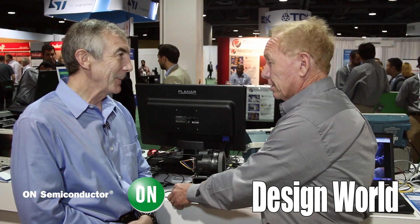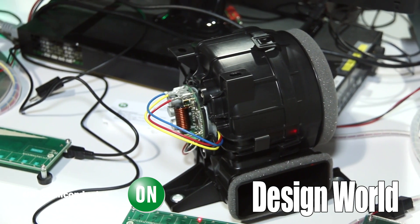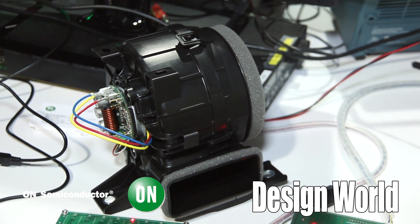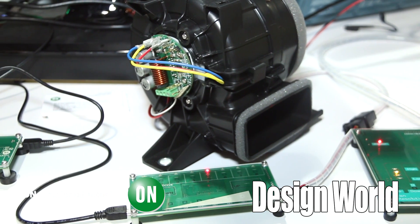The chip is basically a velocity controller — correct? That is correct, yes. And does it do any position controlling? It is actually a BLDC — brushless DC motor — so it determines the position of the rotor based on the feedback from the drive circuit.